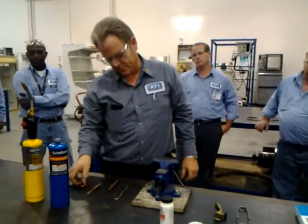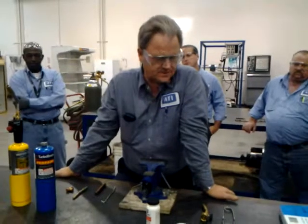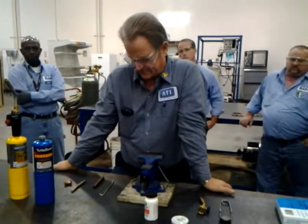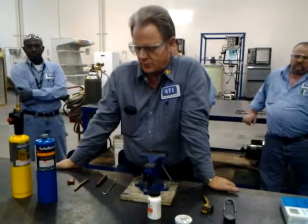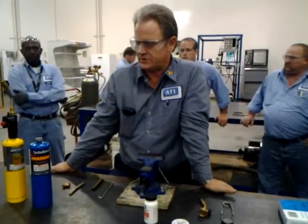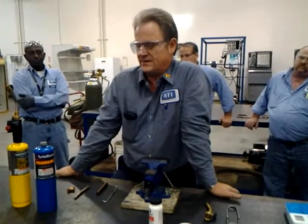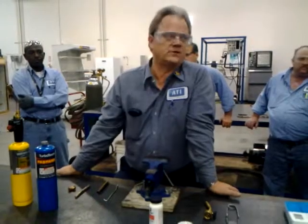It's similar to what you've been doing with brazing. The difference here is the amount of heat that you're going to use. With that project right there we were brazing - we were actually pounding heat into it. We were bringing that stuff up to a dull cherry red and forcing it to get up to 1200 degrees Fahrenheit. That way it was hot enough to melt the brazing rod to it.